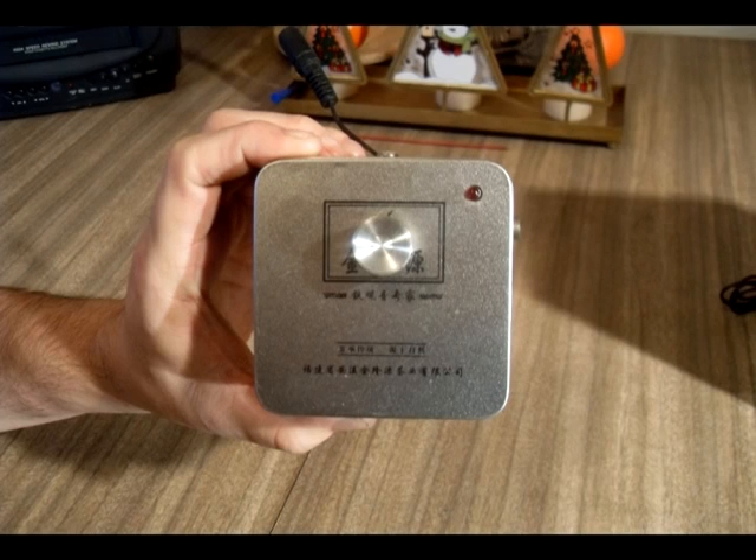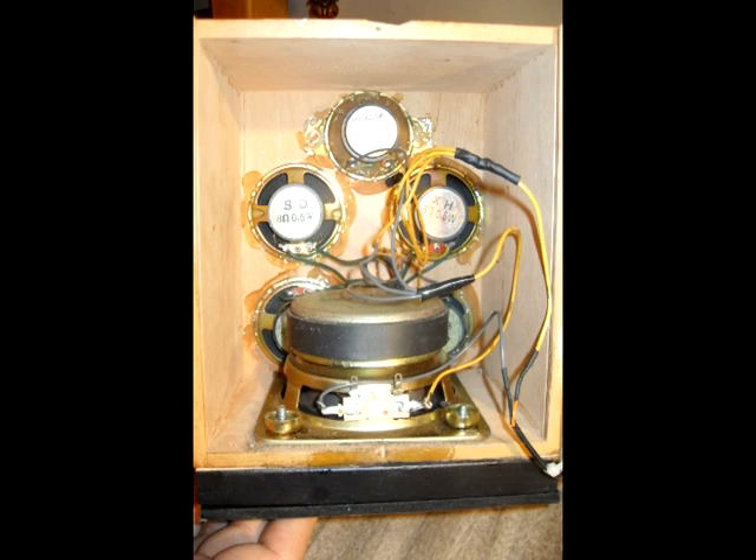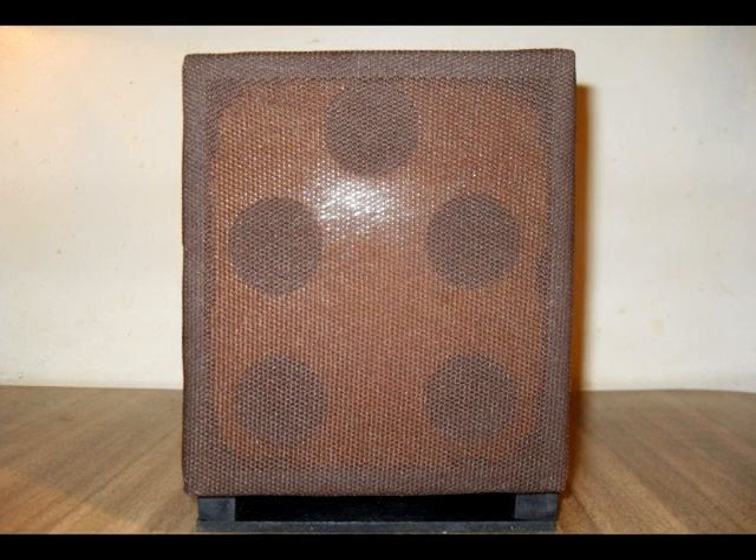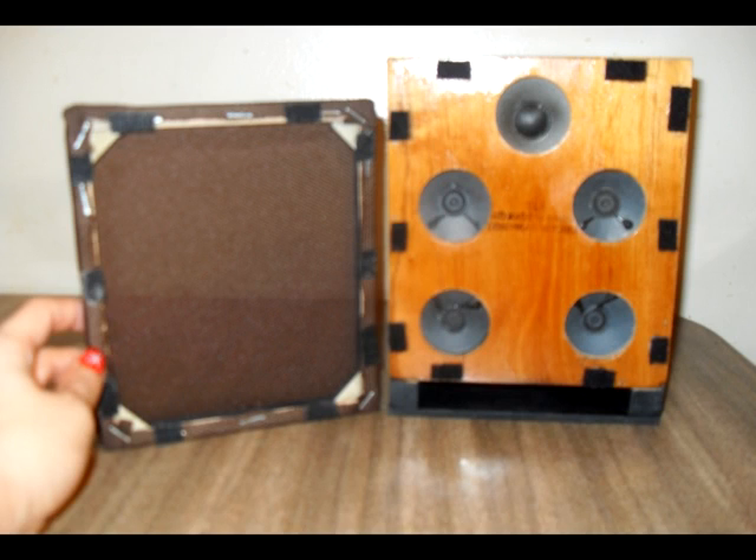Taking a look inside this speaker, it's basically a mess of hot glue. There's a capacitor on the top speaker to filter out some low frequencies — that capacitor was broken, so I matched the value and replaced it. It's a combination of series and parallel wiring to obtain 8 ohms for this unit. Looking at the front of the cabinet, constructing the speaker grill was kind of challenging. I had to make a jig to cut small pieces of wood to assemble the frame, then used triangular wood pieces from my scrap box and a staple gun to hold down the fabric.